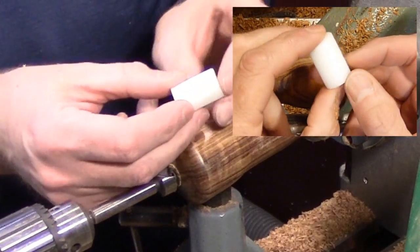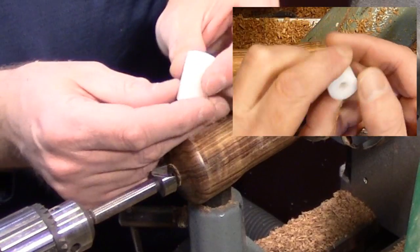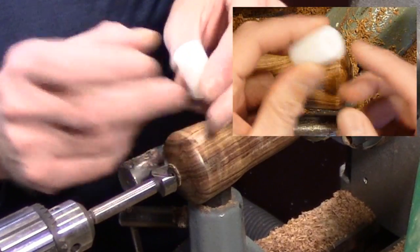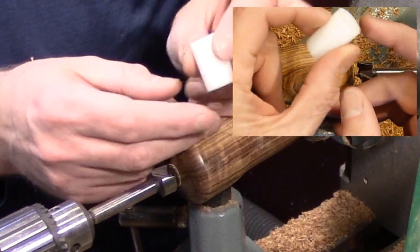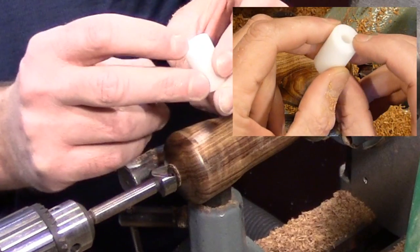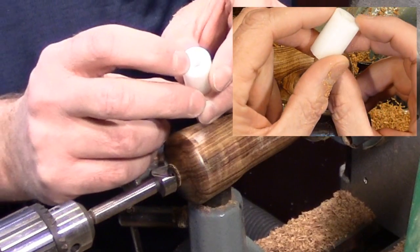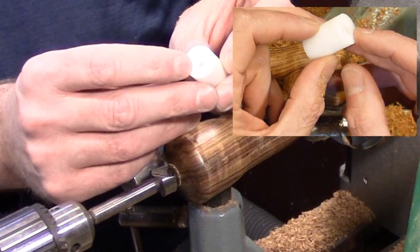All right, I went to a plastic store here in Portland and got some acrylic plastic, and it's soft. It's not brittle, and you really want to get the soft one so that the threads will cut into it. And all I did was drill a hole down for the size of my shifter. What I did is I measured the outside diameter of it, and then I just went one bit under that so that the threads have something to bite into.